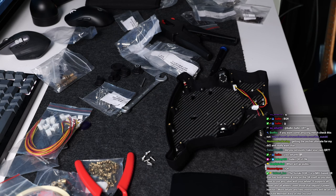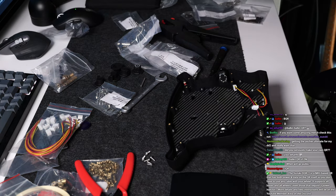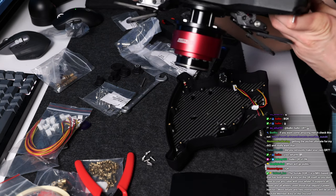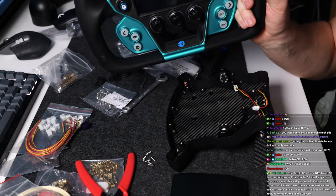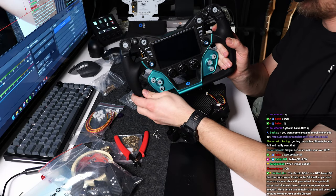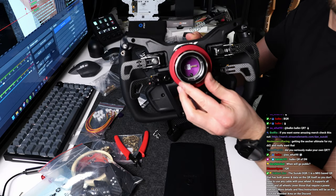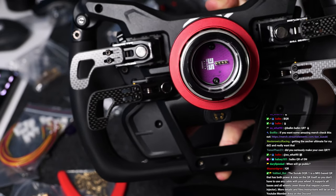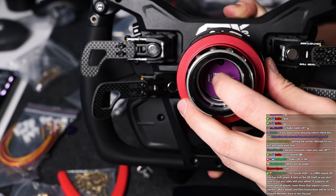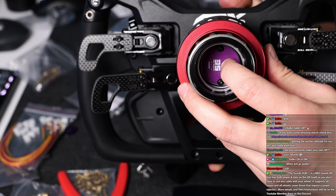Yeah, I can show you. This works with any NRG style QR. So Moza, Simmagic, NRG, whatever. This is, for example, with the Simmagic style. In this case, with a Cube Controls wheel. And it has pogo pins for power, ground, obviously, and USB data. And then on the other side of the board...